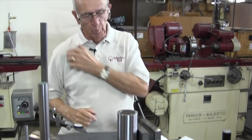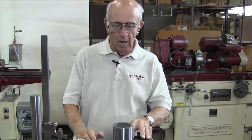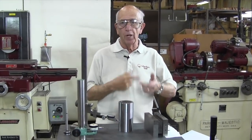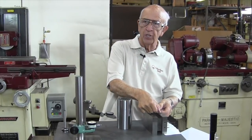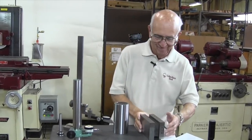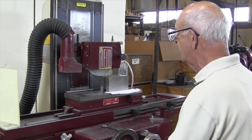Let's go to work. We'll put it on the surface grinder, shim it up, and see if we can bring this thing back in square. There's one other way — grind the shim in there: come down three thousandths and leave it high on one side, then flip it over to the other side. Three ways: grind the shim in, use zigzag paper, or use regular paper, depending on how far off you are. I zeroed it in here so I know where I left off.